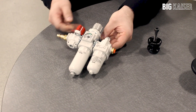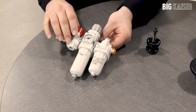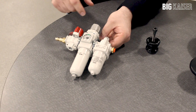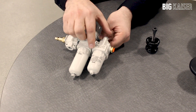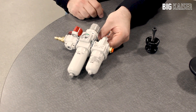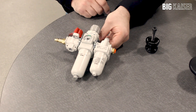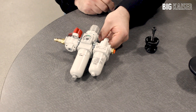The air filter regulator oiler assembly, also known as the air prep assembly, is composed of three parts: the shutoff valve, the filter regulator unit, and the air oiler unit. The oiler unit is used to inject a small amount of lubricant into the air, which will travel into the chuck preventing corrosion of the steel internal parts and degradation of the o-ring seals.